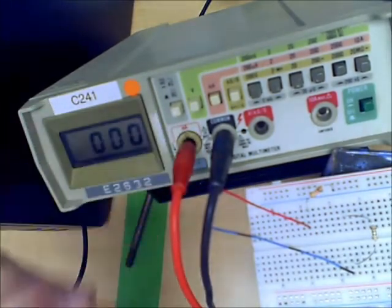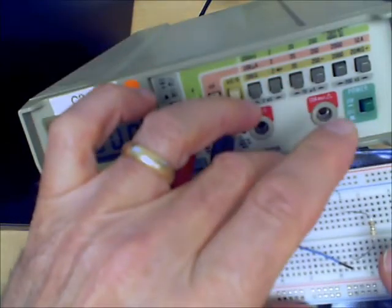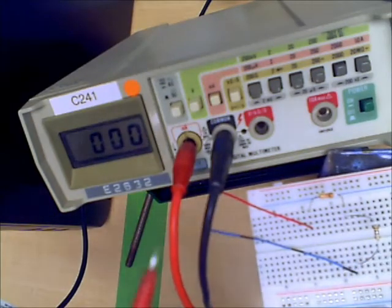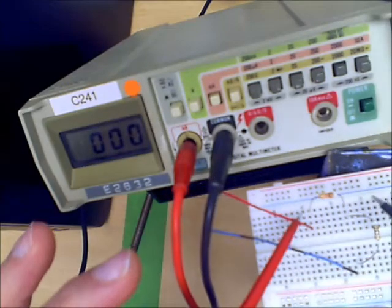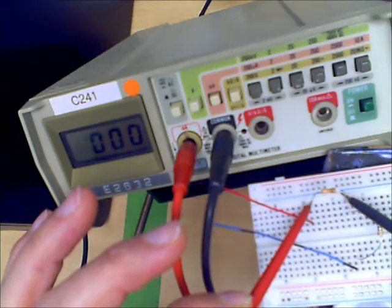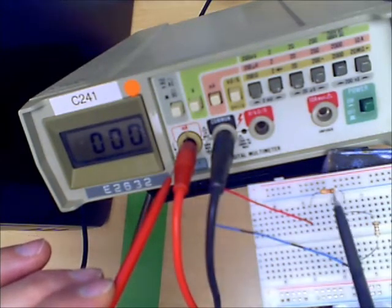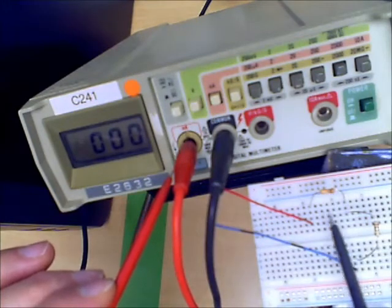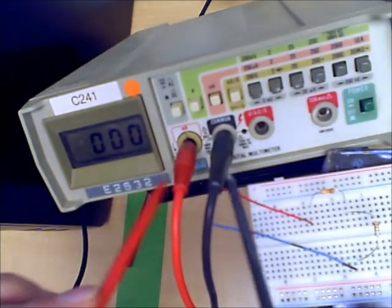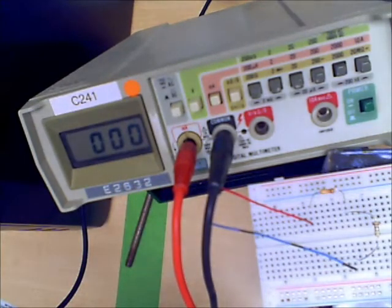Here is the most common way in which people will cause a problem. These two resistors are connected together. I'm interested in measuring the current in the top element. Many people will simply configure their device as an ammeter, and then they will go across that resistor. By going across that resistor, you're putting a device with a very low resistance, since an ammeter has a very low resistance, in parallel with this resistor. All of the current is going to flow through the ammeter, not the resistor, and therefore you're going to get currents that are much higher than they should be in the ammeter, often leading to a blown fuse, and then the instrument no longer works for you.